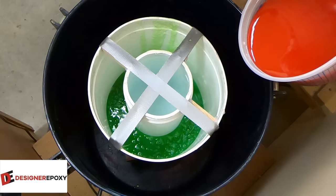There were a couple of little holes in the bottom of these two pieces of wood where I used the circle cutting jig, so I had to turn away enough material to get rid of them. And I prefer to do that before doing anything on the inside. You need to get your bottom set so that you know that it's good before you install your waste block. That way, when you trim the waste block off, you're not going to have any issues, and you don't have to put in a deep mortise to get rid of, say, a hole that's been left behind from the circle cutting jig.